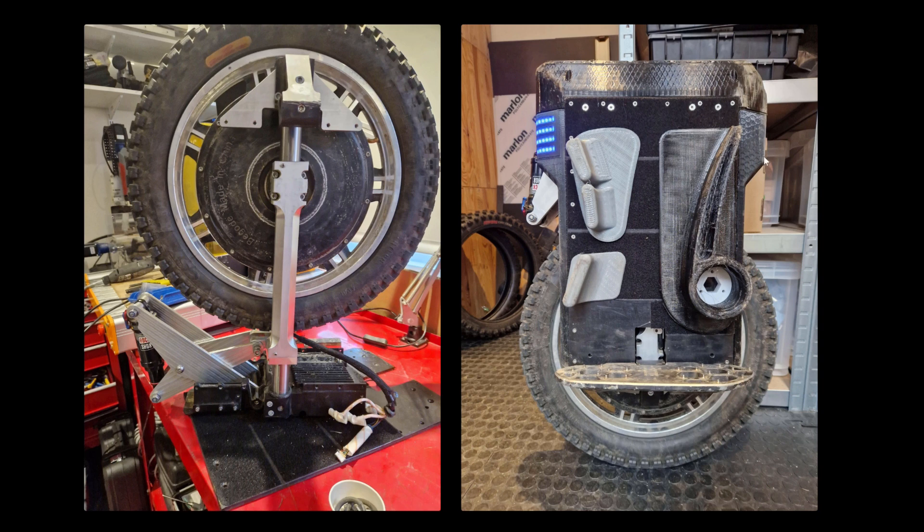The case you see here is something I created before I modified the suspension, basically to make the whole thing more robust and less fragile. It's mainly two nylon side panels with a TPU 3D printed case all the way around, to give it some protection against crashes on the trails. I did also modify the lights to improve those — got rid of the old LED strip and made these in parallel, so they still operate the same as the original stock, but they're brighter and there's more of them. They're also split left and right and work quite nicely.